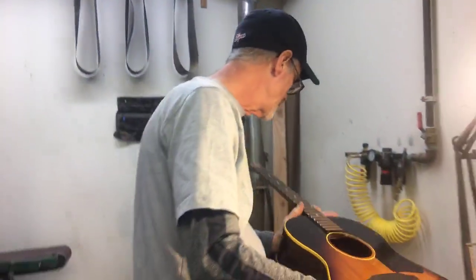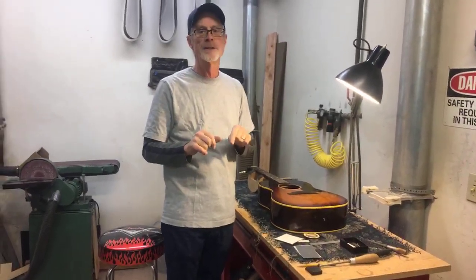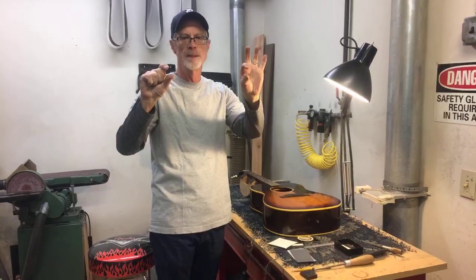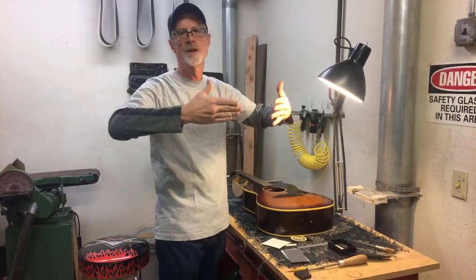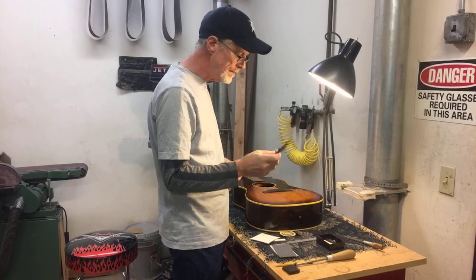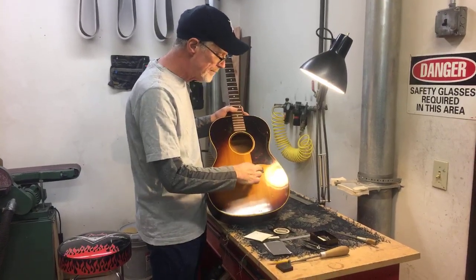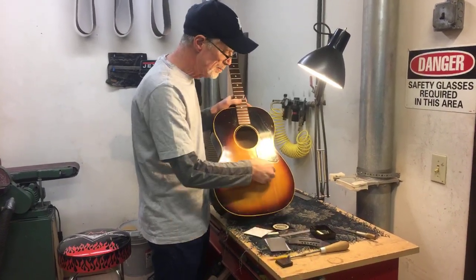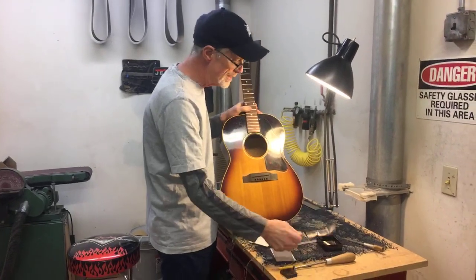Now when I get my saddle properly sized, I will have a fairly even amount of saddle sticking out. It will still be tallest in the middle, the bass side a little lower, the treble side a little lower than that — but not as extreme as on this bridge. There'll be a little more even tension on the saddle from the strings. In addition to making the bridge, once I get the bridge made, I have to scrape the finish off underneath the bridge in this exact profile — the screwed-on bridge is just screwed right onto the finish of the guitar. So I remove the finish and glue it on, so it takes that string tension and spreads it out over the whole footprint, rather than concentrating on those four points.